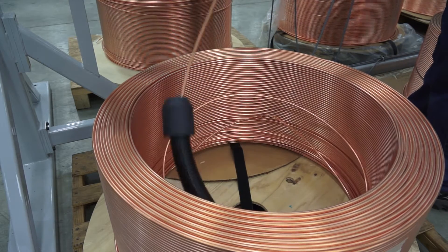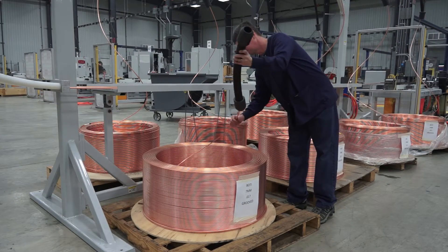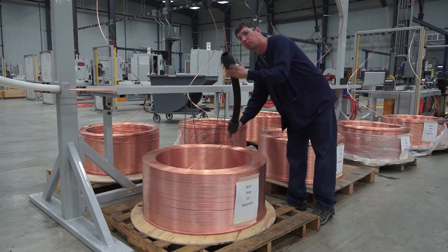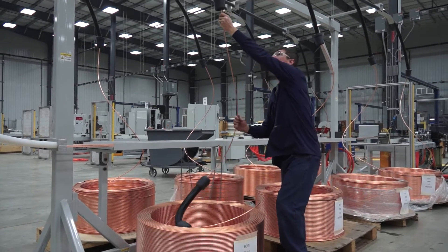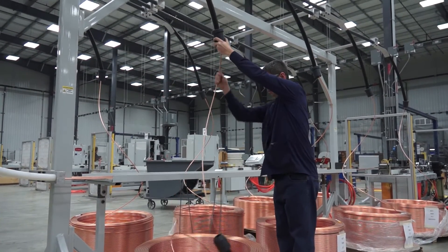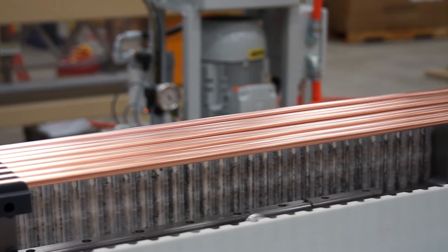For a more effortless and efficient uncoiling process, the Triumph's bottom-entry guide assemblies are designed to function as wedges to separate layers of copper tubing, minimizing tube damage and reducing scrap rates. Guides are easily installed by lacing tubing through the guide before it enters the overhead spiral uncoiler.